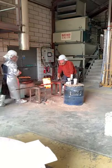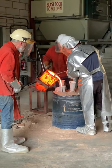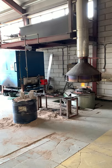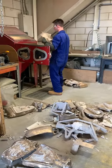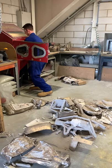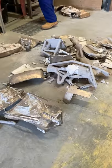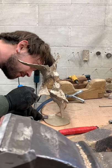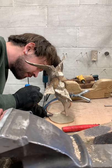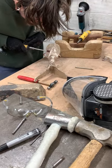The bronze is then carefully poured into the negative molds and left to cool for around about an hour. Once cooled enough, the ceramic shells are sandblasted away and the actual casting is cleaned up to reveal the bronze itself. This is where I finally got to rejoin the swallows — and they look amazing. Here we have Ben just doing the final bit of cleaning, and I'm super excited with how they turned out.